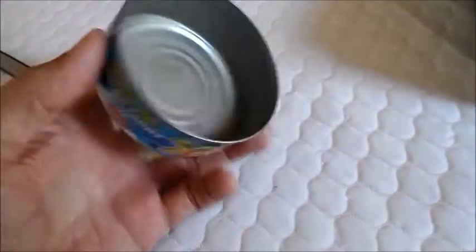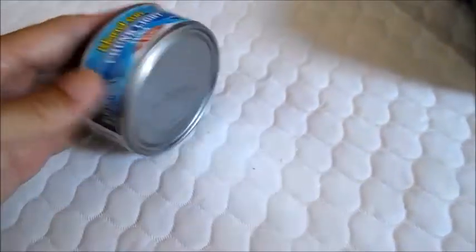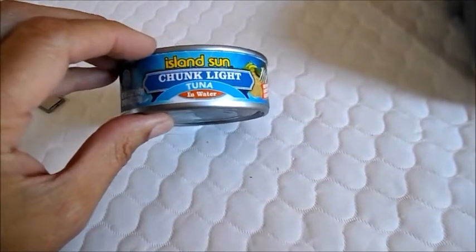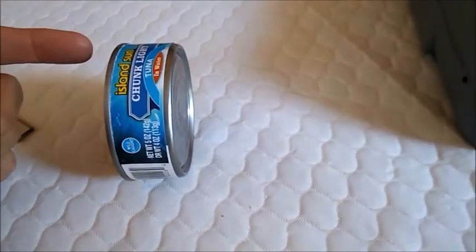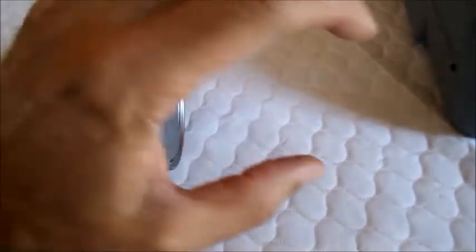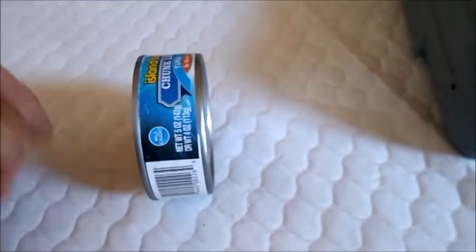This thing's over twice the diameter, so I should be able to take it. I can cut the base off of it. It won't blow out because I can pinch the lip. In there I can put the lip — this is the exhaust gas side, right? So the exhaust gas is going to come around the pipe, press against this, and try to push the metal that direction and blow it out of the gasket, but with that little lip I can pinch it in place.